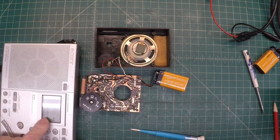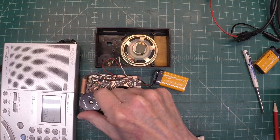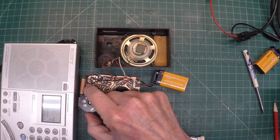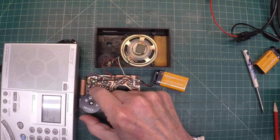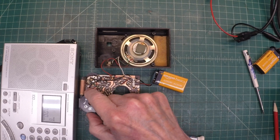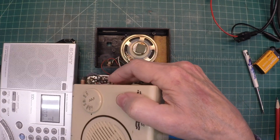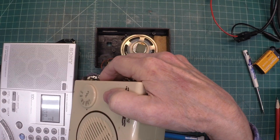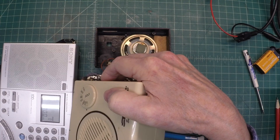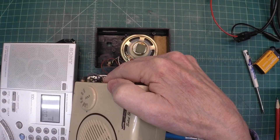Just using another receiver in close proximity here to the loop antenna — just rotate the dial. We should hear a CW carrier. And there's nothing present, just like I expected. So something's going on around the converter side. To illustrate what should happen, with just another working radio, tune across the dial here — and there's the oscillator from that receiver.